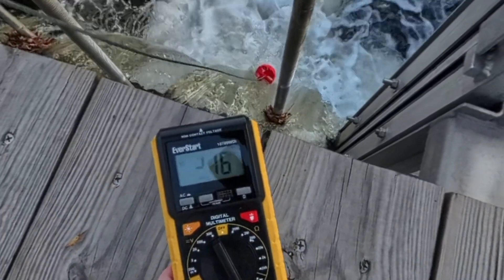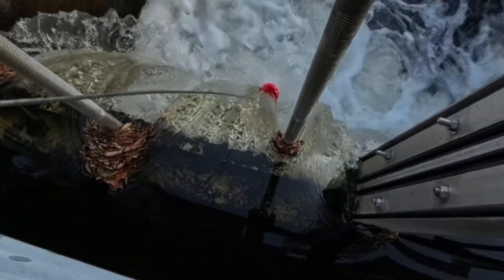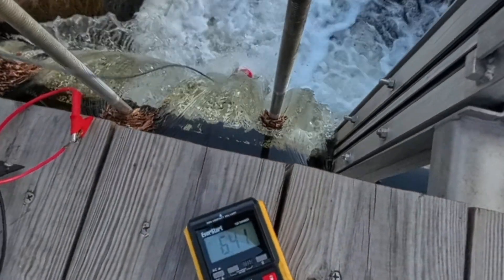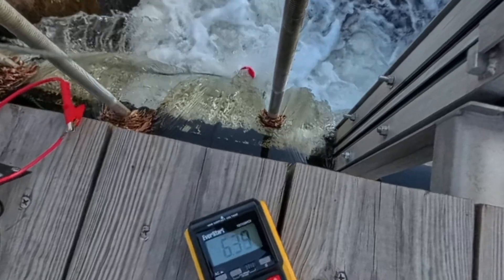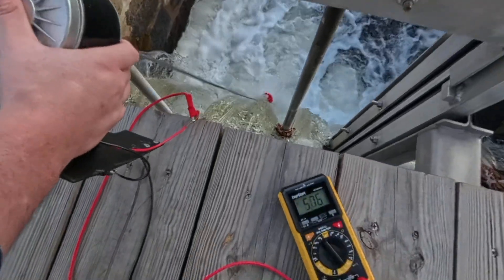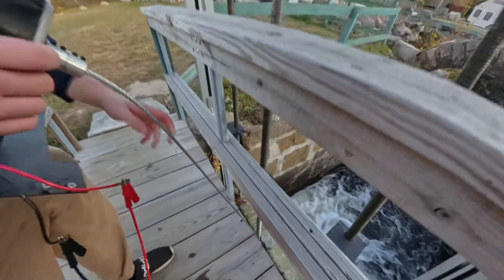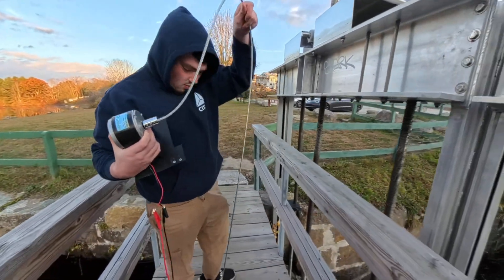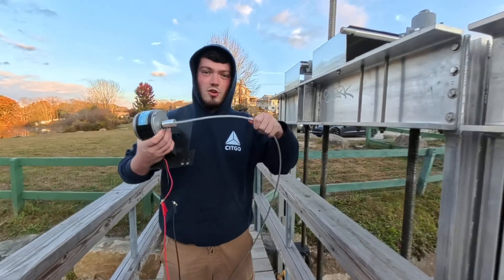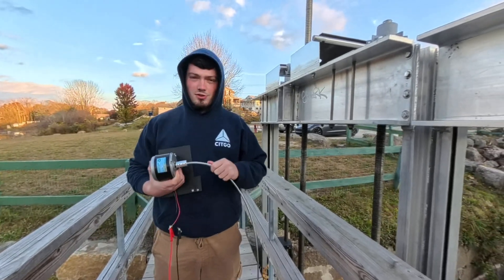I think that's what it is — there's not enough torque. It's violently unstable. What I think is happening with the smaller turbine and the longer cable is it's allowing it to twist — you saw it jumping up and bending around. The turbine did produce more power, but there was no torque. If I tried grabbing the larger one it'd probably be unfavorable for my hand.